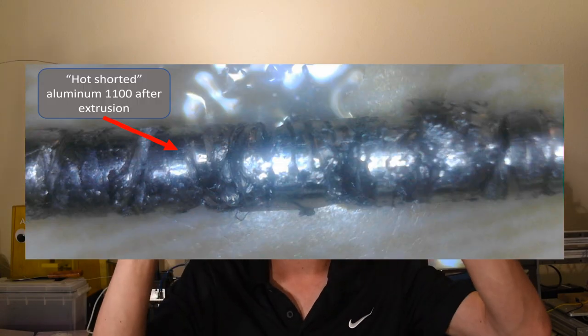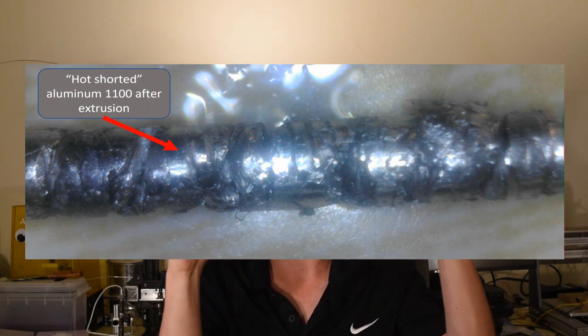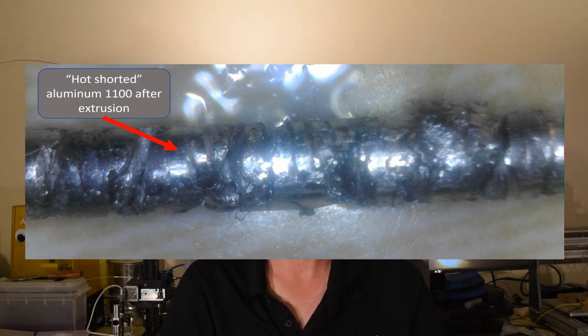And we found a new window for deposition using an entirely new sort of scheme of extruder and motor layout on the printer, where we switched to using a larger die internal diameter, 1.45 millimeters instead of 0.9 or 0.8 millimeters. We're using the larger die diameter because it seems to reduce the amount of hot shortness, basically the tendency of material to expand and clog the interior of the motor shaft.